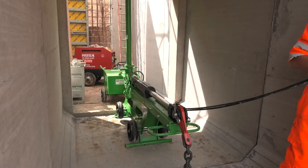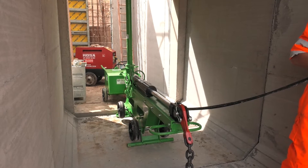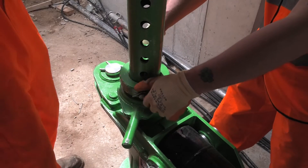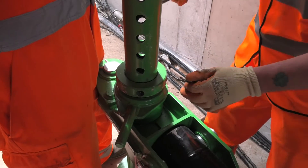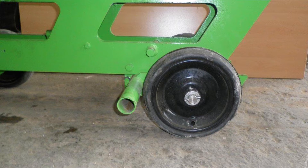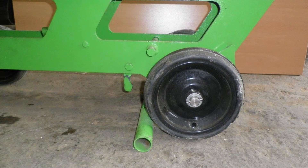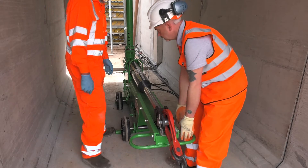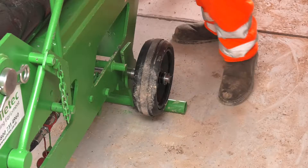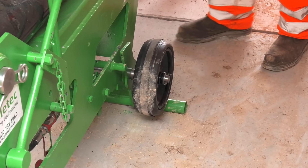To use the culvert puller, place the puller unit, power pack and generator in situ. Remove the pin and slide the prop into the puller unit to the lowest point. Push the lower front bar from its latch to the ground. Lift the front of the puller unit using the double handle and push backwards — the bar goes under the unit and lifts the wheels off the ground.